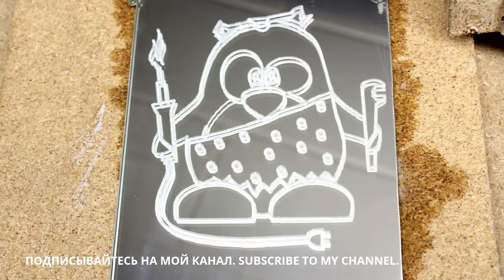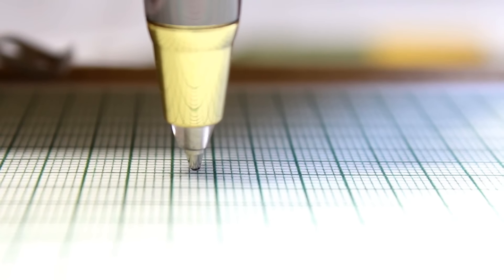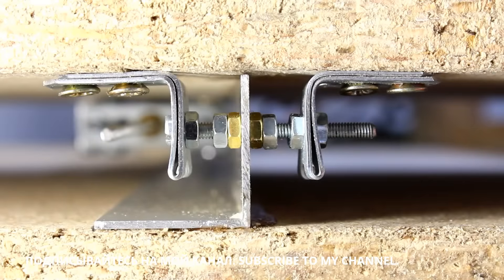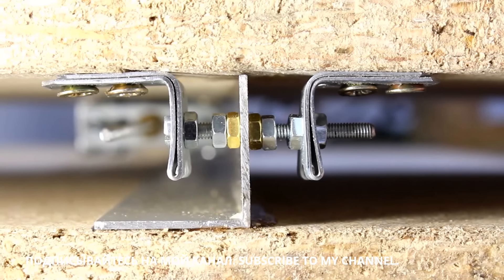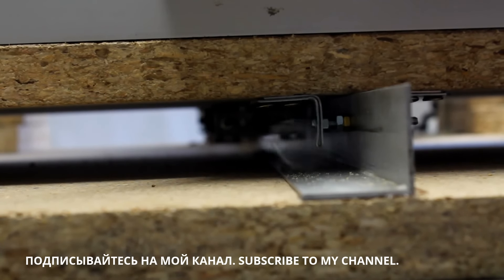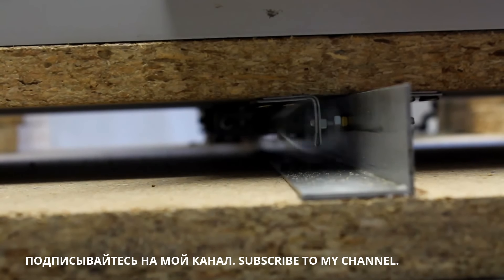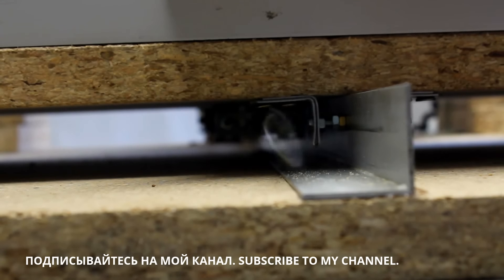The result is really good. In plotting mode there is almost no side load on the ball pen, but the router has to be pulled with higher force over the glass plate during engraving work. As you can see, the aluminum bars as well as the iron angles are deformed under load. The threaded bars are also a source of inaccurateness. The end of the X drive shown here starts vibrating at a certain speed and position. An additional guide will limit the amplitude of those bad vibrations.